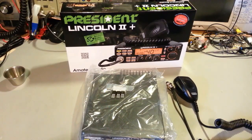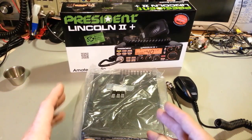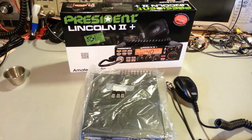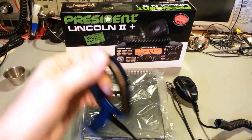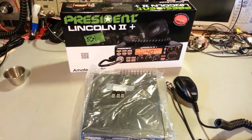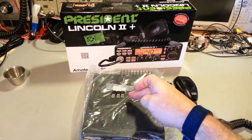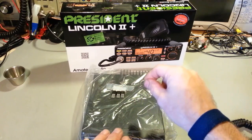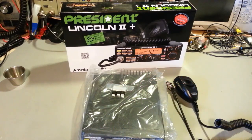I'm going to try to get them off the bag, being as gentle as possible and not moving the bag around much. I'm putting on the anti-static strap so I'm grounded, and I'm working on an ESD mat. I'm also going to clip all three leads together on each one, then try to remove the tape. I just can't think of a worse way you could more poorly package a MOSFET.